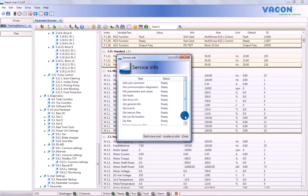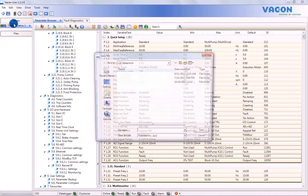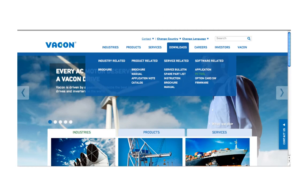The Service Info page gathers and collates all necessary information from the drive and PC and gives fault logs, which you can send to a Vacon service center for further analysis when necessary. This saves time and money, since it means that all the data can be collected from the drive site and service site so that a Vacon technician will only have to visit your site if strictly necessary. You can save almost all data compiled from VaconLive to your hard drive for later use, such as if you need it while offline. For further information on PC programming, you can check out a more detailed walkthrough of the entire Vacon 100 setup on the Vacon.com website, where you can also find application manuals for all the Vacon 100 products. Thanks for listening.